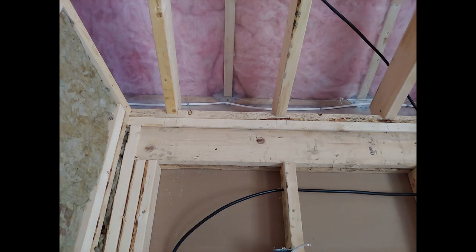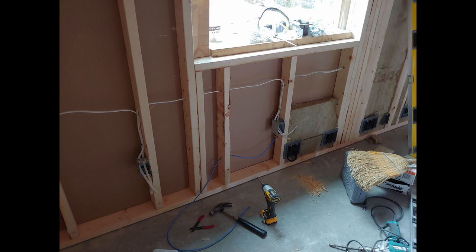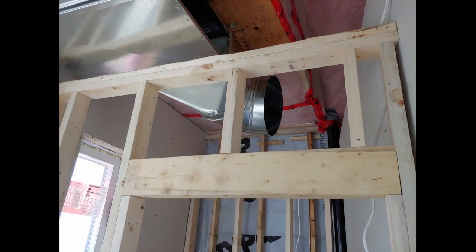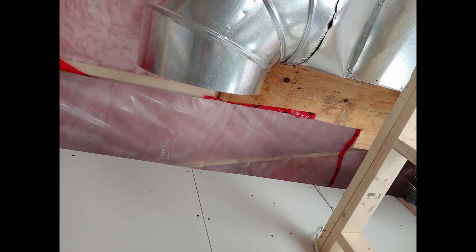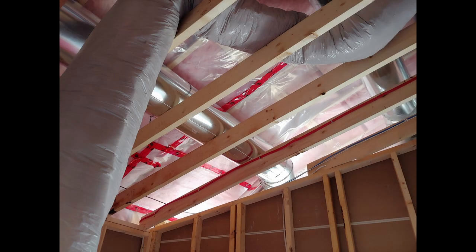Boxes were now in place and I was getting close to being able to insulate the walls with Roxul throughout the tracking room and then the control room. I had also pulled HDMI cable to two locations in the tracking room and control room, as well as one location in the entry. Then the HVAC people started on the install — soon I had these big units sitting up above the entry ceiling, doing metal ducting for part of it and flexible ducting for part of it. I was super concerned about how well this would be isolated for sound purposes, as I'd never worked with these products before and worried about rattling transmitting across the ceiling into the control room or tracking room.